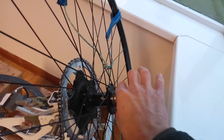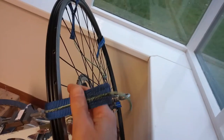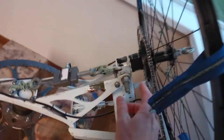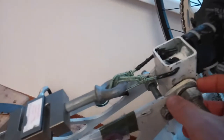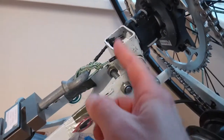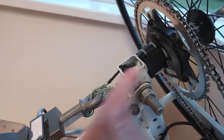Some design ideas: I'd considered putting a load cell out here for tension sensing on the main line. That would possibly also show tension from the whole set as you load it out this way — you'd get a tension reading on there. And on this one we've got this load cell here which is measuring. As that pulls out, there's a slot in here. The hole going through this neck part of this body piece where this bolt goes through is slightly too big, so there is a bit of flex. This tension meter can measure how much tension is going up.